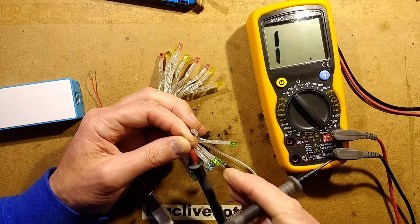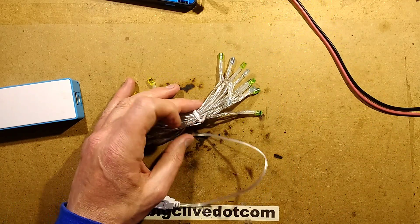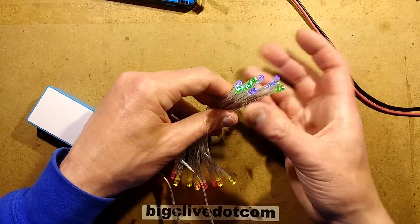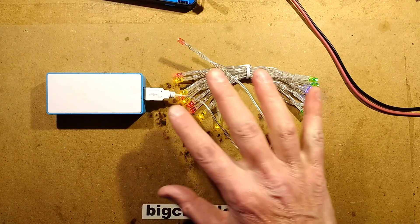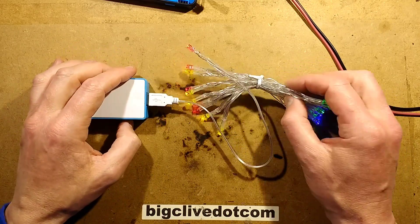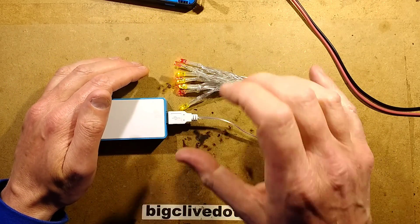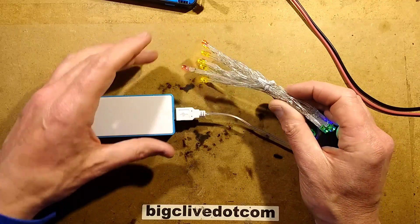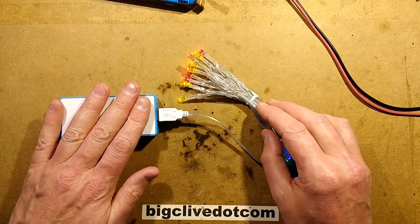That tallied up — I did the maths and worked it out from the current and the expected voltage drop across the resistor. 100 ohms is an interesting value, because it means these LEDs literally just draw about 20 milliamps. If you're running them on a modest power bank they will run for days continuously, and the intensity will stay the same. Now there are two types of power bank: ones that do not have proper cell protection, and when it gets to the end of the cell's capacity and drops to about 3 volts, all they do is stop boosting to 5 volts. With those, if you connect these lights and at end of life they step down in brightness instead of going out decisively, they're still drawing current and will actually drag the lithium cell down to 2.5 volts or below. So the best type are ones that properly disconnect the cell so they just cut out decisively at the end of capacity.